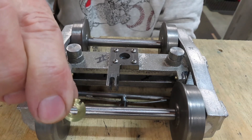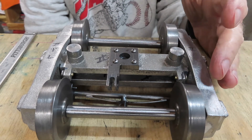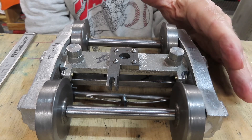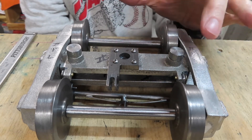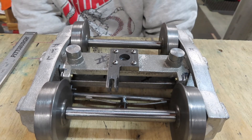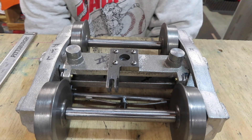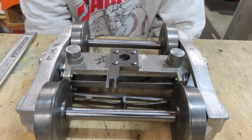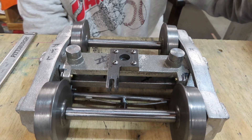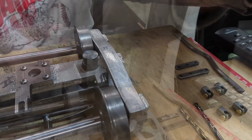Just to point out: if you buy the extra-thick shielded bearings you probably don't need those brass shields. I'll take this apart now and bring you back when I have it all put together — get the fit arranged and do a couple of other minor things. Once I'm completely satisfied with this set I'll take it all apart and paint the side castings. I'm not sure if I'll paint the wheels since not much will be visible. We also have to make the brake bar that goes across underneath, which means some silver soldering and fitting of the lever arms and clevises.